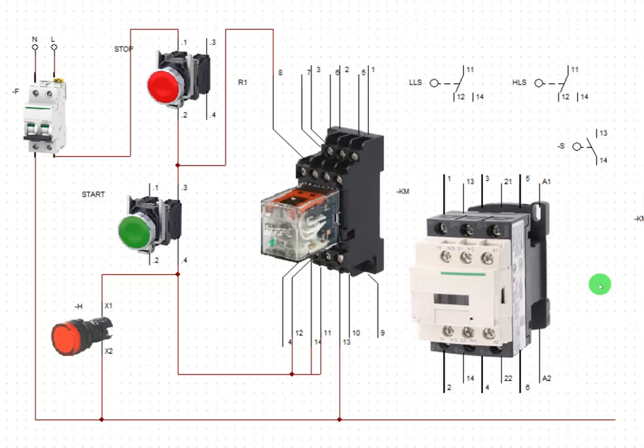But if you are using a three phase induction motor, when you buy the motor, it should come with an enclosure, a starter box. If you are using three phase, maybe the end user had already decided to install three phase before you were invited. In that case, the motor would have been installed with the panel already. Having gotten the panel and the pump, what you need to do is to design this to incorporate it into the existing panel.